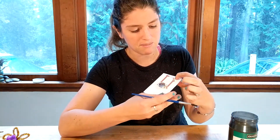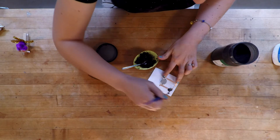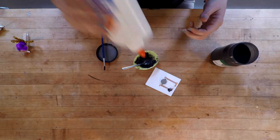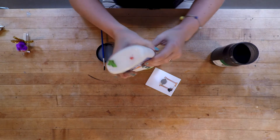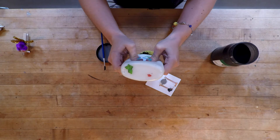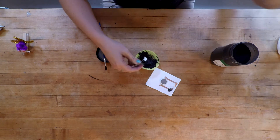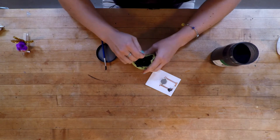Once you have it, you're going to add it to all your joints. On this paper I have a piece of tape that comes here and joins another piece of tape — so I want to do it there. I'm just going to paint over it like that. You don't really need to worry about what it looks like. If you're going to make LED cards or light-up animals, you can always hide that glue under a layer of paint if you don't want the black there. You just want to make sure you're getting a good connection, because it's a bummer if you do all that work and then it doesn't light up.